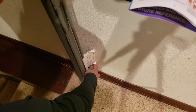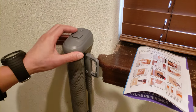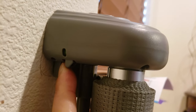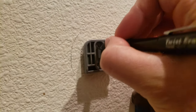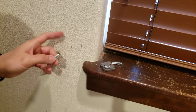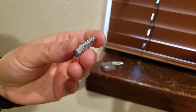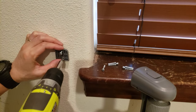In the event you have a baseboard like mine, simply pull this up and locate it in a position away from the baseboard. I'm going to press with the adhesive tape and find my location, which is in line with the stud. Now I'm going to mark the hole locations, then remove the bracket and drill the holes. Since I'm drilling into a stud area, I don't need to use these expansion screws. Insert the screws and make sure it's the right orientation — I had to redo it because I had it upside down.